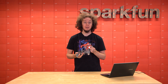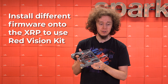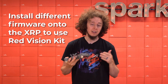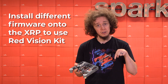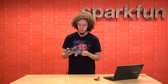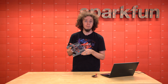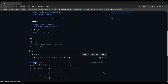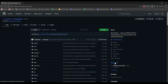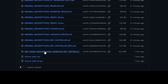If you get a Red Vision Kit for your XRP, here's some information on how to get started. Before doing anything with the hardware, it's important to note that you'll need to install different firmware onto your XRP to use the Red Vision Kit. This is currently a manual process, but if we come out with a more automated process, we'll put some updated instructions in the description. Also be aware that this will overwrite all files on your XRP, so if you have any important files on there, be sure to back them up. As of right now, the firmware can be downloaded from GitHub. Go to our fork of MicroPython, then the releases tab on the right side, and within the latest release, expand the assets to find the Red Vision MicroPython XRP UF2 file.